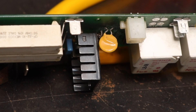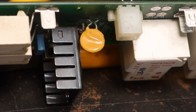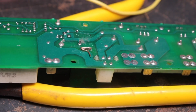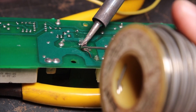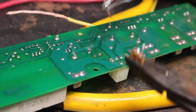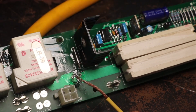The first thing we're going to do is remove this component and replace it with the new one. In order to do that, we need to desolder the pins on the back side. There was another option where I could send the whole board in and have a professional do everything for $140 or so — which, in hindsight, was probably a better option. But then I wouldn't know how to wick solder out of a hole.